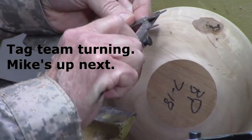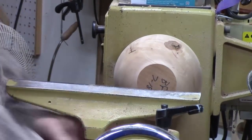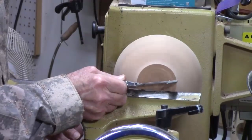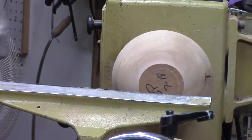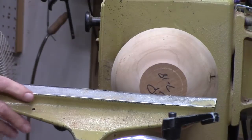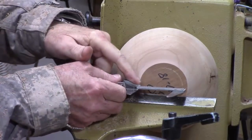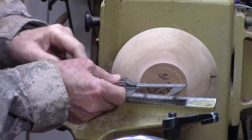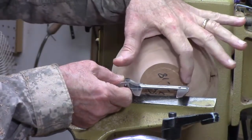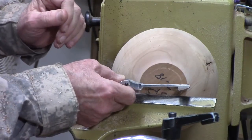Let's see if we can get the rest of that with sanding. Now for the size of the tenon — we're just going to roughly mark that. When you did that with your calipers, were you touching both of the points or only one? That's a good point to emphasize. I only touched the lower point, bracing myself on the tool rest, while watching the other one float over the scribe mark. I don't do both of them at the same time because that tends to cause problems.